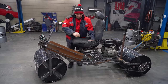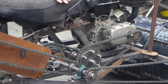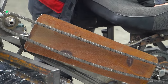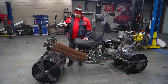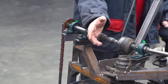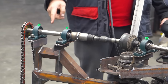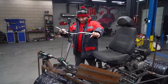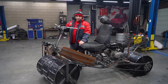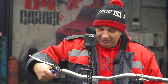And this is what we end up with. We did have to fit a bunch of extra chains to the intermediate shafts, because none of us calculated the speed — so lots of extra parts, but whatever. This chain is connected to the drum up front, and up here we have yet another intermediate shaft connected to the drum via another chain. Over here, that's just a regular old automotive CV joint — it'll allow us to easily steer the vehicle while torque is being transferred to the wheel. We don't have much steering angle due to the drum pushing up against the frame. We actually had to weld on a restrictor to prevent the drum from snagging while driving. Overall, I'd say we've done pretty well with this moped.